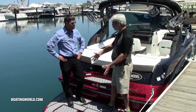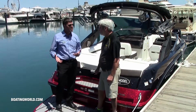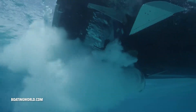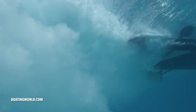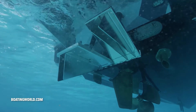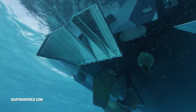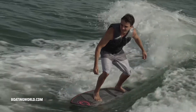Tell me about the running surface and what makes it create the wake. Below the waterline you've got a combination of features: the dynamic running surface, which are the tabs on the outside — they dig into the water and allow you to get up on plane very quickly and level-set your boat. Then in the center you've got our surf fins, which operate independently of each other and actually carve your pocket and clean up your wake so it's nice and smooth in the rear.